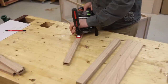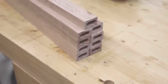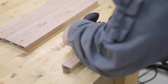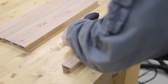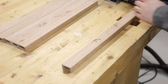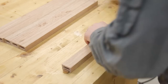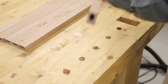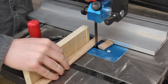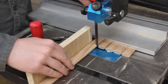After the leg assemblies were glued up I could start work on the joinery for the face frame, which was again dominoed. This created a nice stack of modest rails. For the central vertical face frame members I had to set the domino to the shallowest setting and domino on both sides. I mentioned at the start I make my own loose tenon stock, so I cut that to length at the bandsaw.